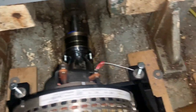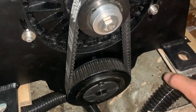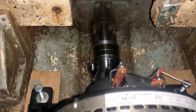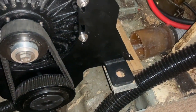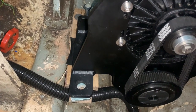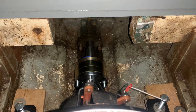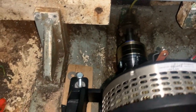I've got the motor to just about the right height. I cut a piece of plywood here and here, then used shims to lift it up so it slides onto the coupling. The back needs to be very slightly higher than the front, but a few washers lift that up. I think I've got enough information now to measure up for the actual motor mount that I'm going to get fabricated, but I'd still like to get this to the stage where I can actually turn the prop.